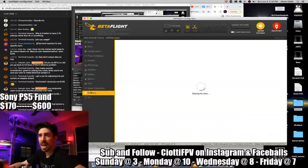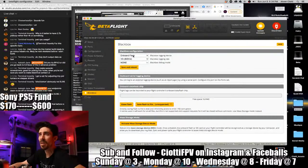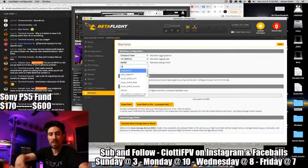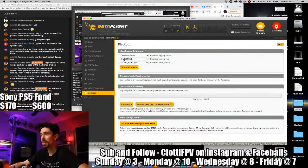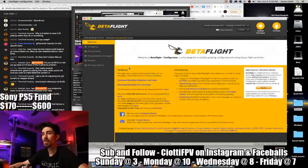So we're gonna save that, and then black box, the last thing here, onboard flash. Huh. I don't know these hertzes anymore. It used to be in K. That's interesting. But we definitely want gyro scaled. So we're gonna put the black box to gyro scaled. I'm gonna leave it at 1/4, save and reboot.